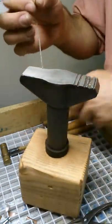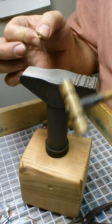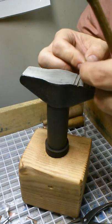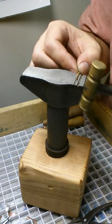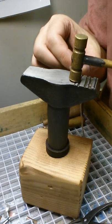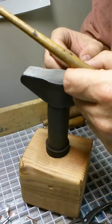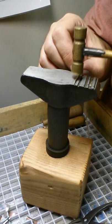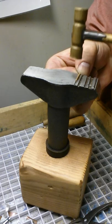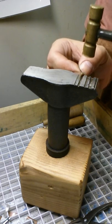Now the next trick is we're going to take a brass hammer, which is the same metal as the aglet. I discovered that using a hammer made of the same metal leaves way fewer marks that have to be cleaned up later. So we're going to put this in a groove here, find a groove that fits, and we're going to just hammer this over and start rolling this metal down. The idea is that we will end up with a round aglet here eventually.